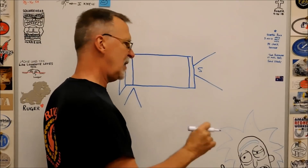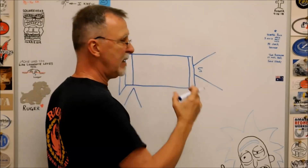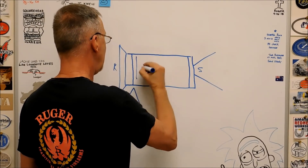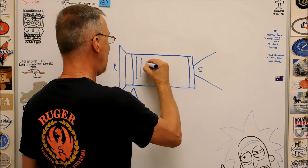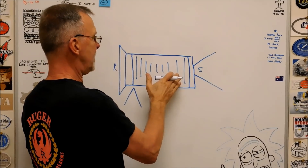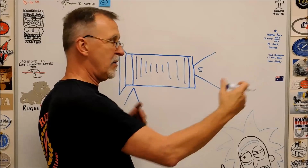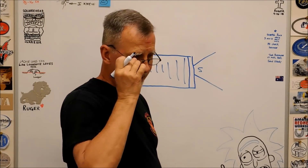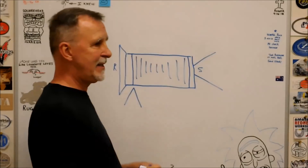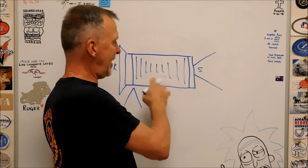Take that scratch pass as superficial as you can — just barely touch the material. Engage that half nut and run that first pass. If this line starts to deteriorate or goes intermittent on you — like it could start big, taper down to very little contact, stay there for a bit, and then start coming back up — the material is telling you that it's moving away there. It might be small on one side, big on the other side. You have to look for consistency. If this is happening, that is telling you: hold the music, stop. This is no good.